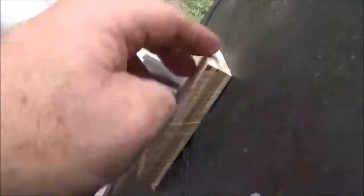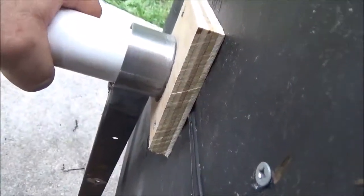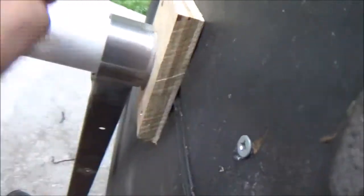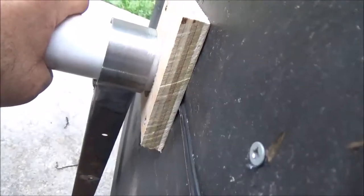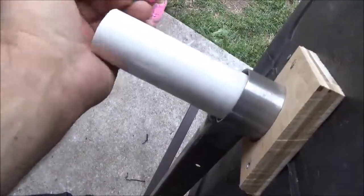Alright, I finished. I put the boards on the side like that on both sides. I ground off all those screws that were down there, and I put a spacer on the outside right here to keep it from rubbing. If I wanted to, I could drill a hole through this plywood on both sides and put some 2-inch screws through there to hold that tight.